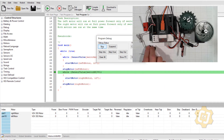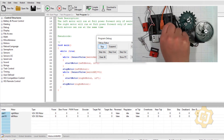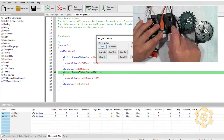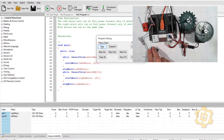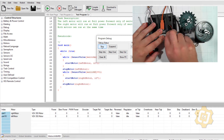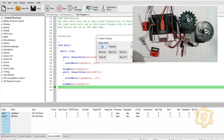Now let's try it — hit start. We can still run that one. The bad part is I could have a bad motor or a bad port. So first I'm going to try swapping the two motors. I know this one worked, so the motor is not the problem — it could be the port itself. For some reason that port seems to be bad, so I'm going to have to add a motor controller onto it so I can plug it into a different port.